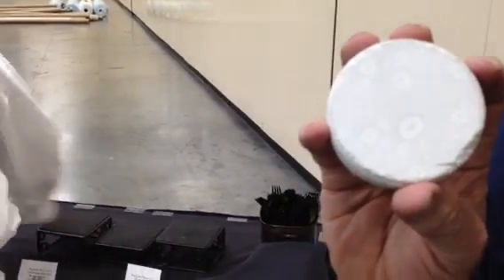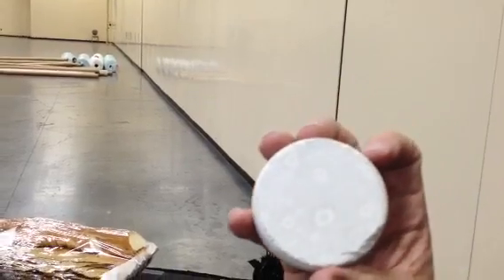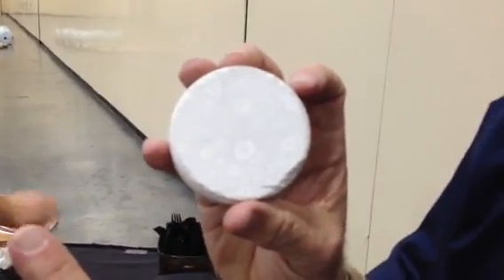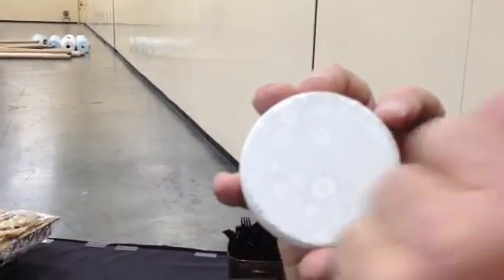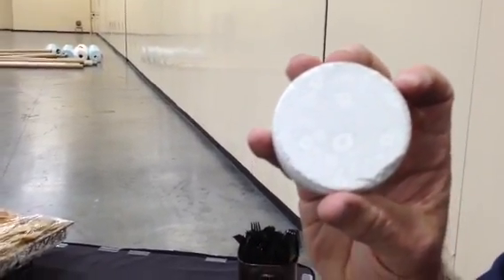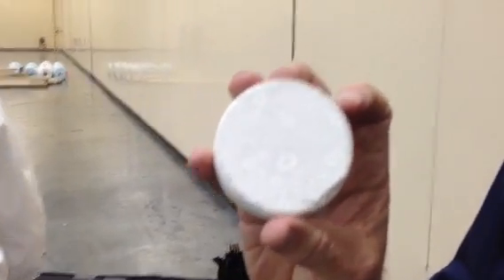So the calcium chloride is causing the grain, and the calcium chloride and hard troweling contributes to that overall grain effect. The white spots are a twofold effect also. When they have to trowel a hardened plaster that is hardening faster than they can get to it, they have to throw water onto the surface to try to make it workable again. Since the plaster surface is somewhat rough, as they trowel they start disturbing some of the aggregate sticking above the surface and they jiggle the aggregate. By jiggling it, it creates a weakness point where water can penetrate. Also, calcium chloride causes microcracking — that's another defective issue with adding too much calcium chloride to the mix.